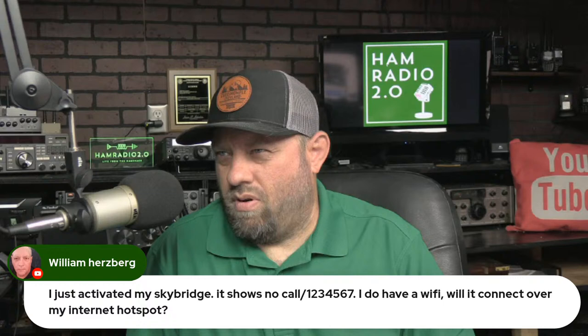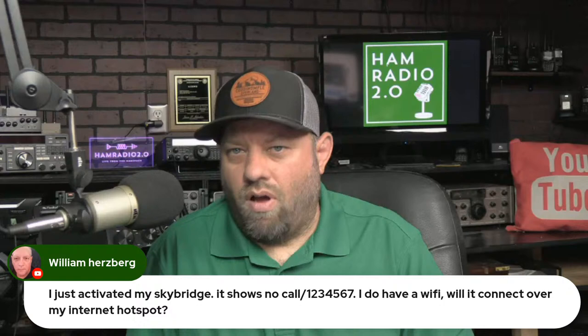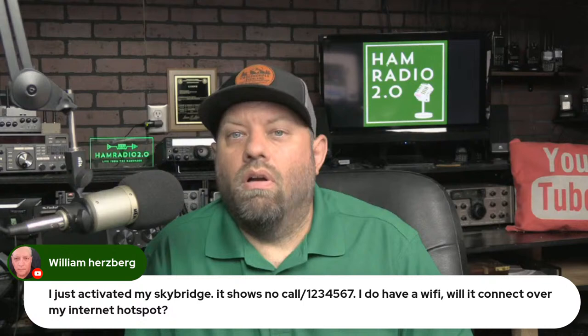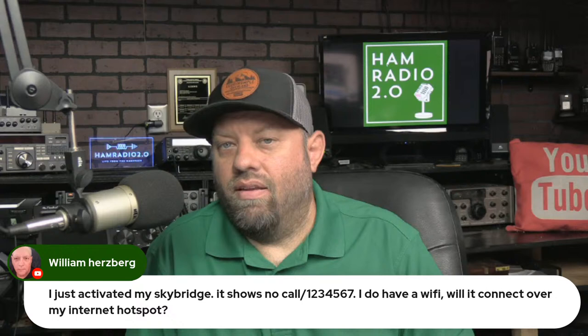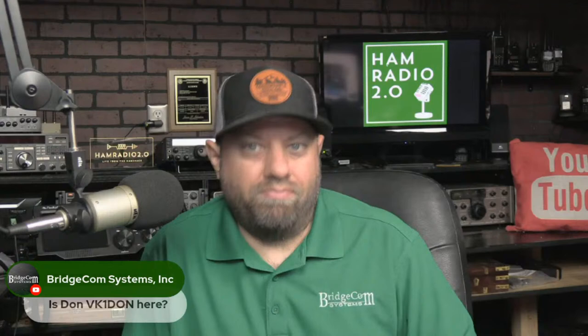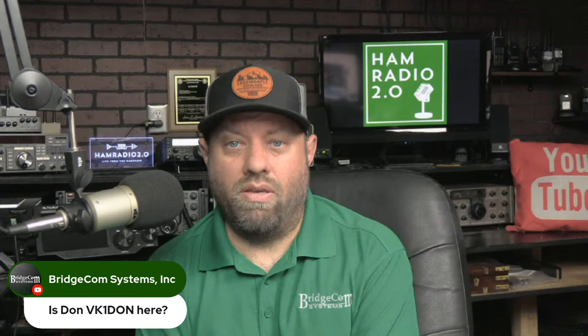Yeah, so the easiest way to do that, William, is to temporarily plug the Pi-Star into your Ethernet router, log into it, and then do a scan for your Wi-Fi and add your Wi-Fi network to Pi-Star. Save it, reboot it, unplug it from Ethernet, and then it'll connect to Wi-Fi, and you can log in via browser that way. It's a multi-step process, but yeah. And then you have the no call. That no call 1234567 means you haven't put your own subscriber ID in there yet, and that's normal. That's how they all come. So you just want to get that set up correctly. That's the easiest way to do it: plug it into Ethernet, scan for Wi-Fi, connect, and then use it on Wi-Fi from then on out.